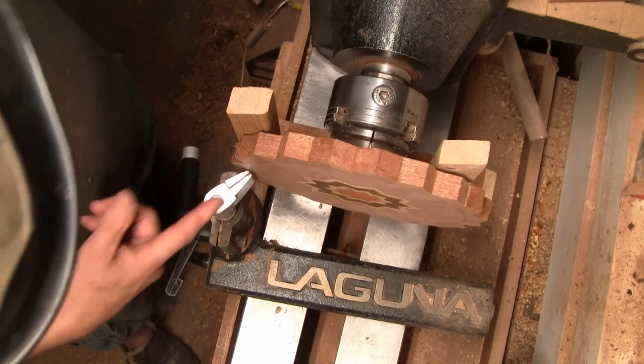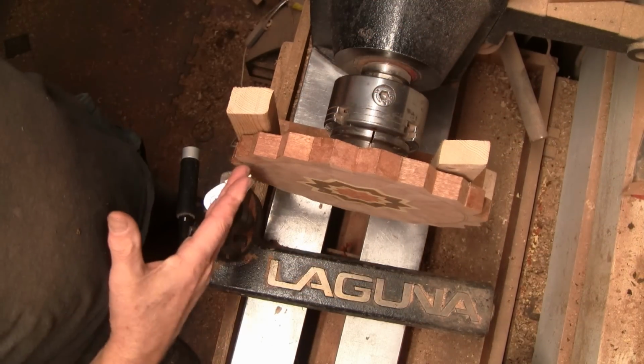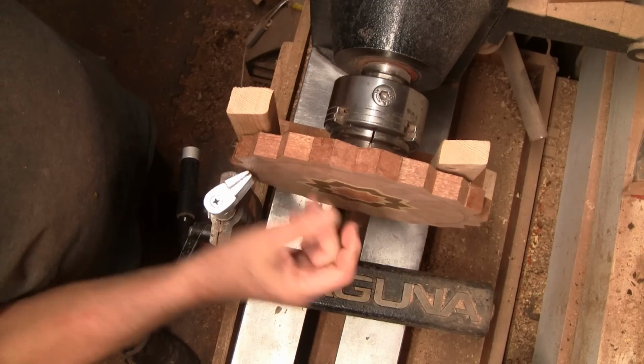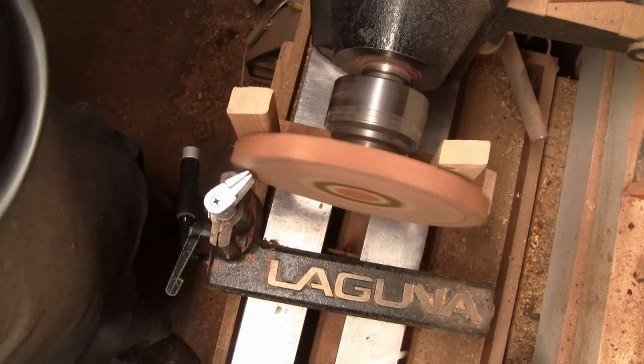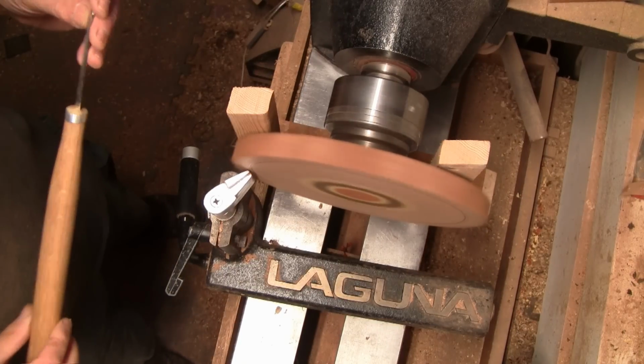And I don't think I mentioned, but I'm cutting a 40 degree angle on this. It's going to be more straight up and down. And the reason is I don't have a lot of room here and I don't want to cut into this. We're doing about 500 RPM.